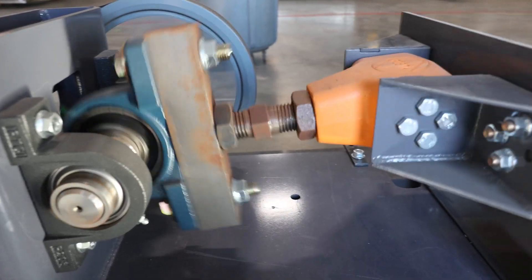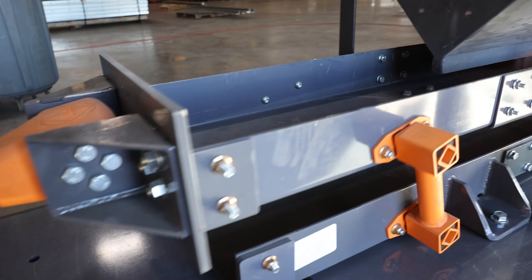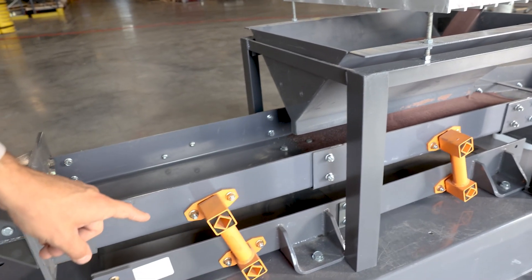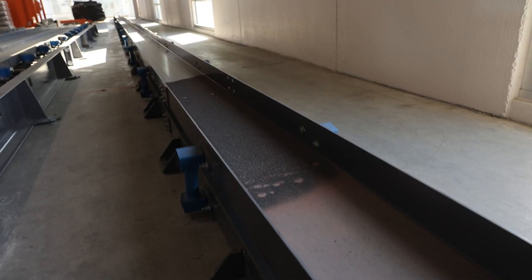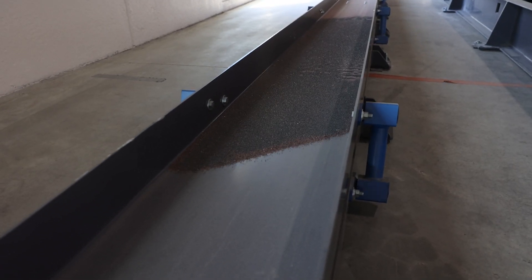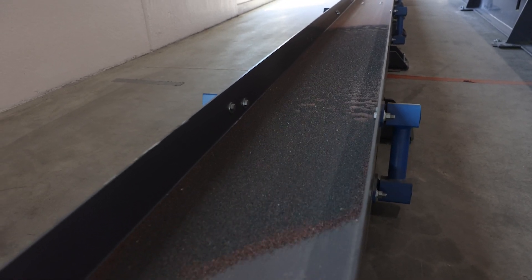The way the system works is a camshaft connects with the conveyor. The conveyor itself is not at a slope or angle. Physics propel the abrasive forward via the oscillating motion and subsequent path of inertia of the grit. These can be extended into hundreds of feet if necessary and come in standard section sizes of two foot to ten foot, and can be arranged to assemble in any one-foot increment.